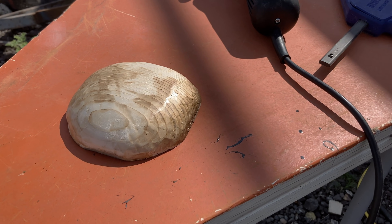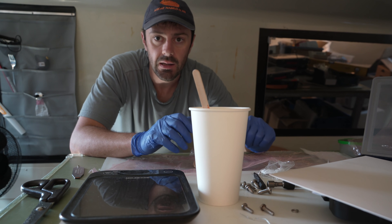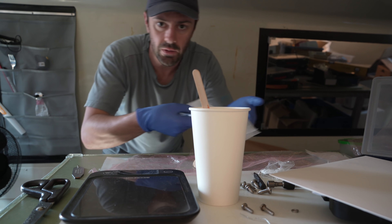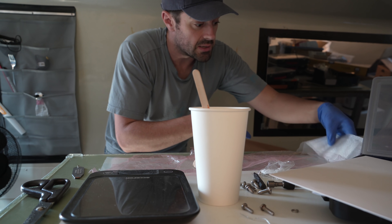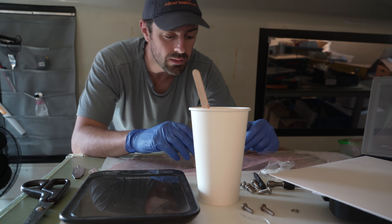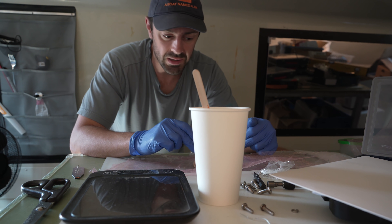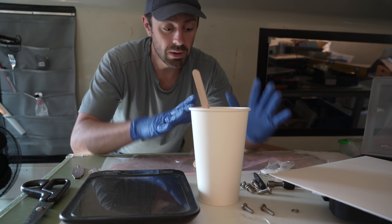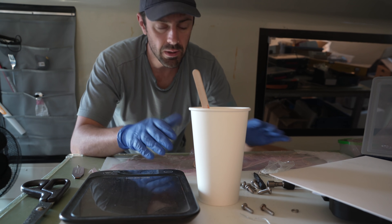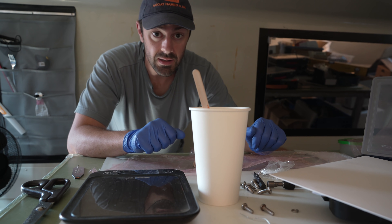For the composites work — this is going to be a test piece, although if I'm happy with the end result shape and strength, then I'll probably use it. So now what I want to do is laminate some layers of really high quality glass fiber, which I've cut into strips. This is woven, and I'm going to be doing it at different angles to improve the strength. That's going to be on top of this wooden pattern — or positive mould — which has some release film on top of it. And then once that's laid up, I'll put another layer of release film on top to make sure that it cures properly, and then we'll see what we end up with in the end.